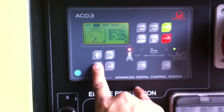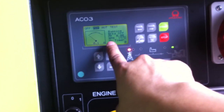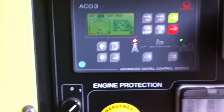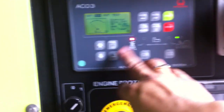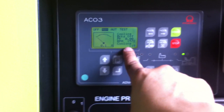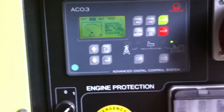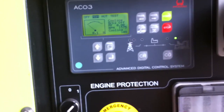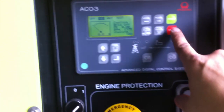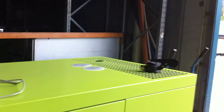Back on the main screen while it's running, you can see power factor and revs. There's no load timer at the moment. This amp gauge shows the amount of amps being pulled from the generator under load. When you want to stop the unit, press stop. There is then a cooling delay period — so that when the generator is under load it can shut down safely. For turbo models they definitely need to be cooled down; the default time is 120 seconds. In manual mode you can stop it straight away by pressing stop again and the unit will stop.